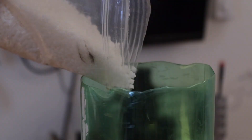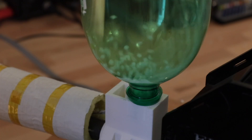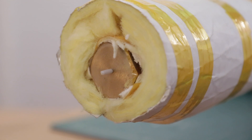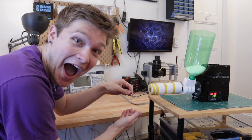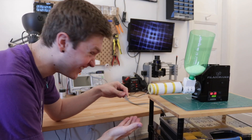This first test is coming out really consistently between 75 and 80 thou — I don't know what that is in metric, my calipers only have imperial. Google tells me that's somewhere between 1.9 and 2 millimeters. I think this nozzle was designed for 1.75mm filament, but my TAZ 5 takes 2.85mm — colloquially 3mm — so I'm going to drill this hole out and make it much bigger so it makes filament that fits my printer.